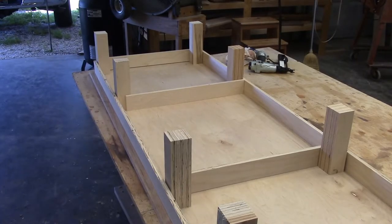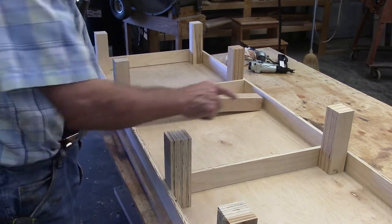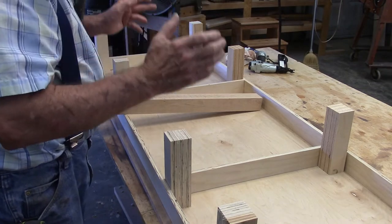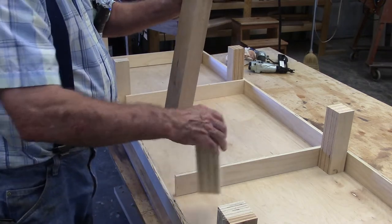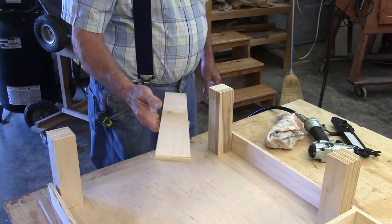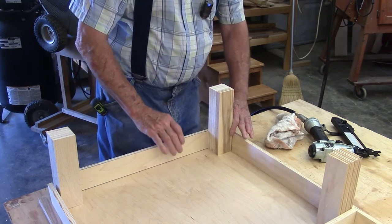What I'm working on here is the table jig. How this works is you make this little frame and you have these little stumps in here that stand in for the legs that are the exact dimensions of the leg. And then when you take the jig off, you have your frame in place and then you can just install your legs. These are gone, and this is the stock for the legs. All this table jig is just little scraps of remnant that I put around the piece.